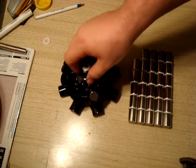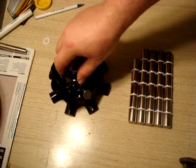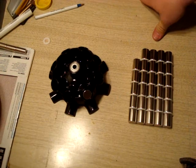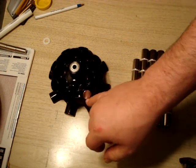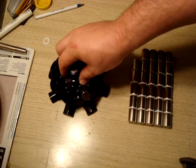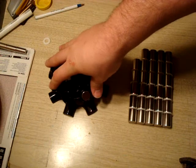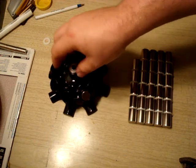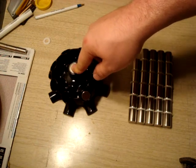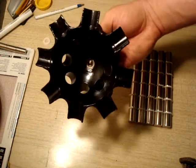That's the update. Again, the magnet placement, and there'll be a magnet in every single hole. The magnets weigh about 4 pounds for this rotor, so it's going to be a massive rotor. With the correct size magnet, even though they are just a little bit bigger than these, it's actually going to increase the whole weight of the motor to about 4.5 pounds, almost 5 pounds. So the rotor is actually going to weigh quite a bit by the time we get everything said and done, which will give a lot of centrifugal force to the motor as it's spinning. So it's going to give us that little extra boost as well, so we can get away with our smaller core coils that'll be on the inside.